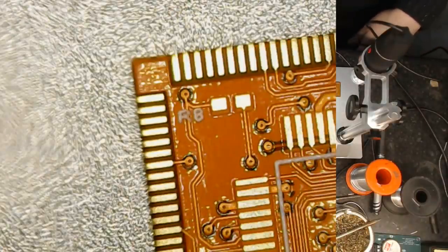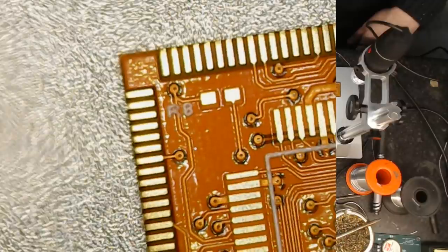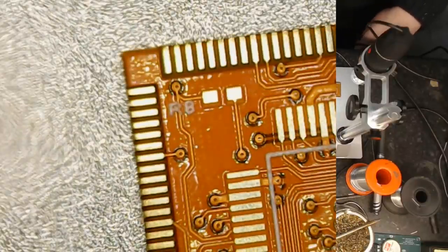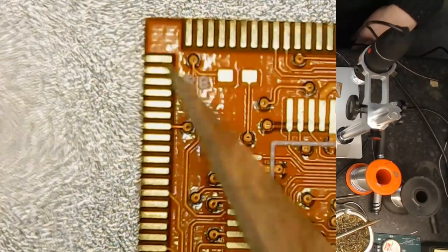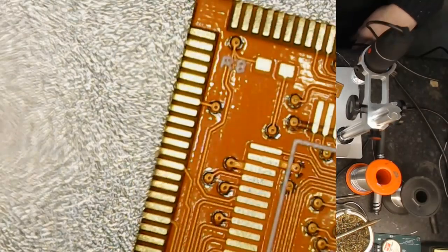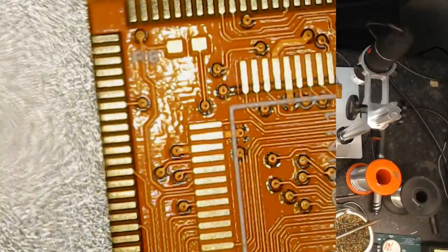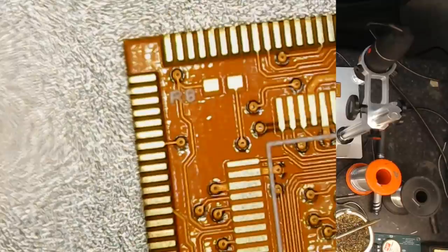Now, what drew me to using this process for this board is down to the fact that it's extremely thin. This board is 0.2 millimeters thick, and it is a four-layer PCB. And as you can see here, we have these gold-plated pads right out to the absolute edge of the board. Now, this was another element of this process that drew me to it. So when PCBWay got in touch with me and wanted to sponsor a board and sponsor a project, and I got a look to see what they could do,